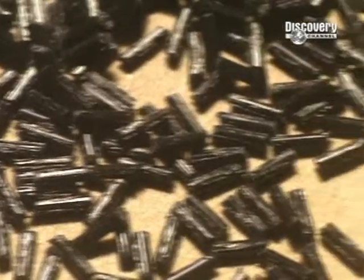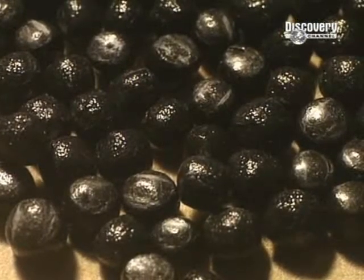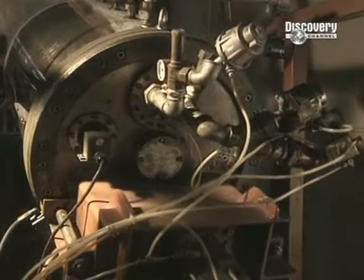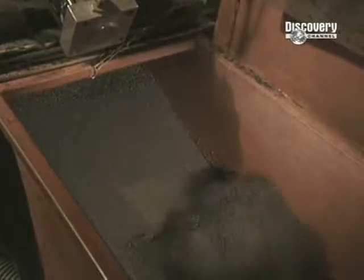The foam interior of the helmet that will be placed inside the shell is made of polystyrene beads that will expand and bond together. This expander increases the volume of the granules that fall into it. Steam and an agitator force the polystyrene beads to expand uniformly. The granules are now ready. The contents of this bin will be able to produce about 20 foam pieces, which will take shape on moulds.